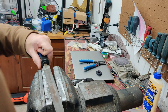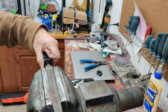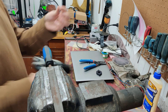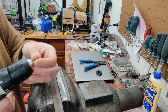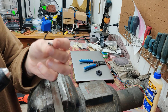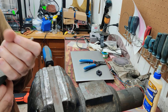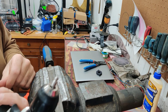First off, I put this file here in my vise. Then I take the heat break and put it in the drill chuck using the smooth end. Be careful when you tighten that chuck — it doesn't need much tightening. If you tighten it too much, you'll end up with a nice triangular hole. Just tighten it enough that it stays in place.